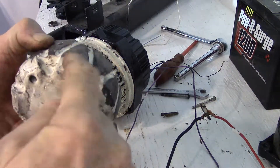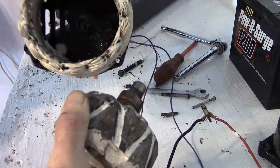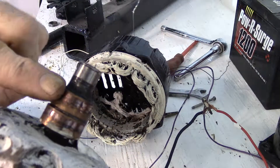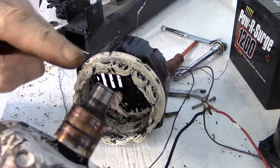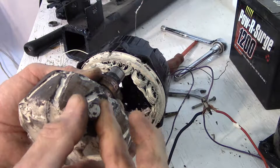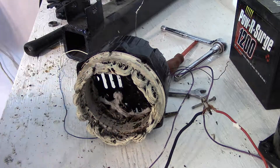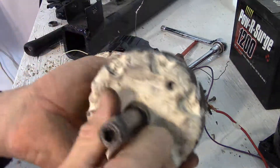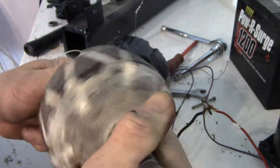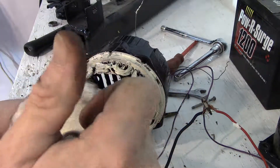To do it right when you're putting them in the rotor, make sure you mark which brush is positive and which one is negative, and which part they connect to. Then energize the rotor and put your magnet over top of it so you know you're putting the magnet in the same way as what it's trying to produce its field. That's how you do it. Then just silicone — I mean fiberglass resin it together. Paint it if you can because these things aren't really weatherproof, and paint helps, but don't put it on too thick.